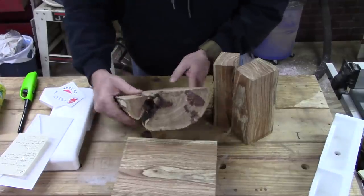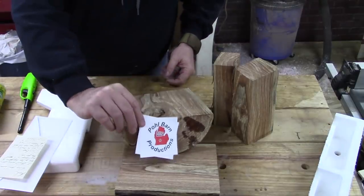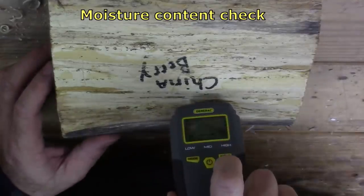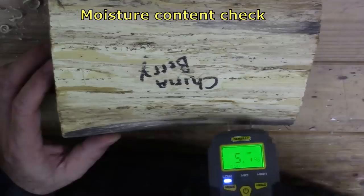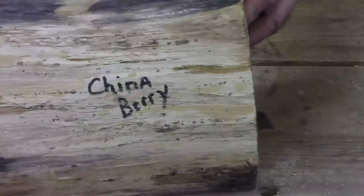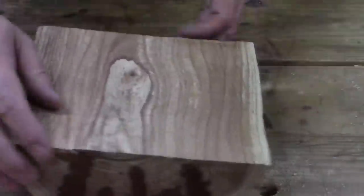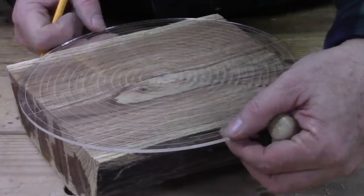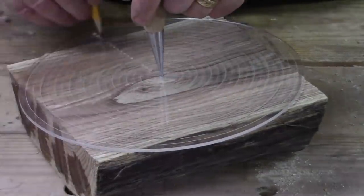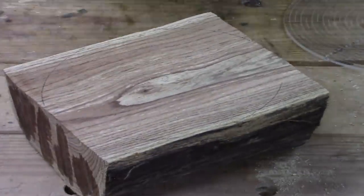It's really pretty wood — I like the grain, I like the color. Doug had CA glued all the cracks there that you saw, and also in his video he mentioned that the wood might have been wet because it had checked on him badly when he was turning. So I was just using the moisture meter to get an idea, and although a probe type moisture meter only tells you what's going on about an inch deep, it was fairly consistent all the way around — got as high as about nine point something percent moisture.